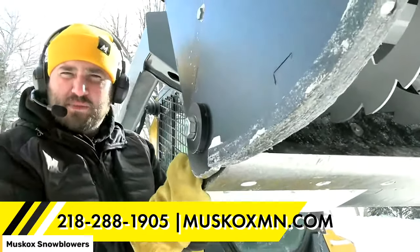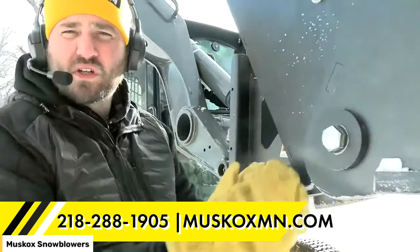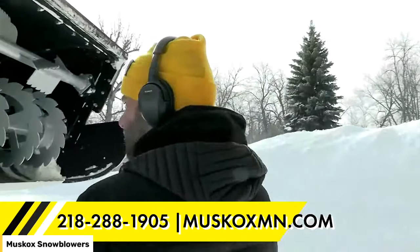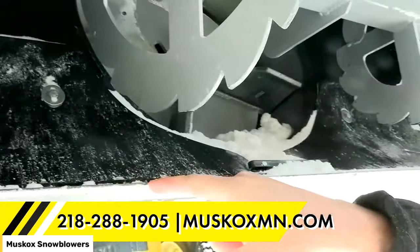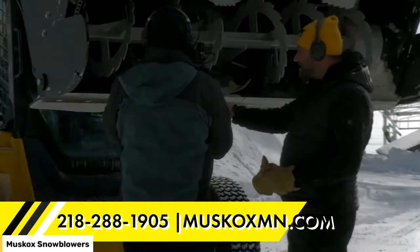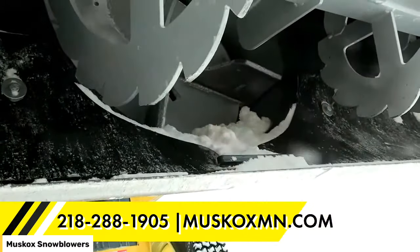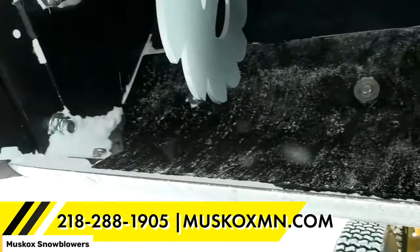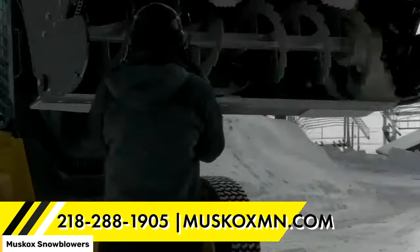This is our natural ride position — not to scrape surfaces, rip up grass, or pick up rocks on gravel driveways. But we have a unique opportunity because at any time we can rotate that bucket and ride right on the steel cutting edge. This machine has about 150 hours on it and we have not taken off that steel cutting edge — you can still see it's sharp and looks brand new. It lasts a long time because we only use it when we need to.